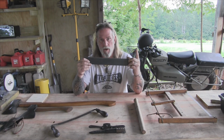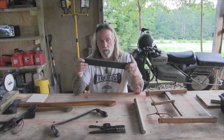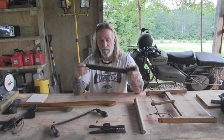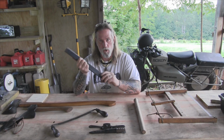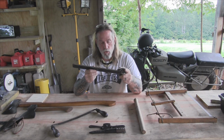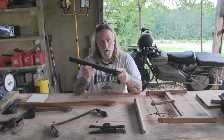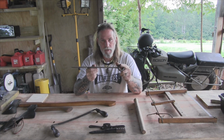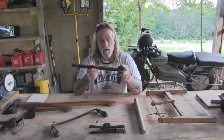So you're not going to tear up your axe or dull your axe or take a chance on breaking a knife that you're trying to baton to rive things out with. That's what a froe is the workhorse for. It's a pretty heavy tool. Again, it really requires conveyance to carry something this large. You could scale this down a lot smaller than this and get a lot out of it.